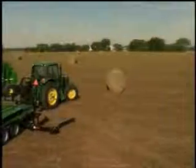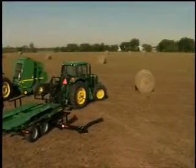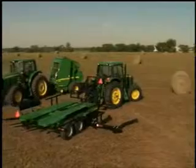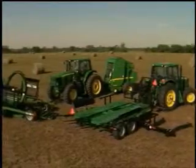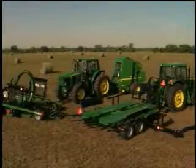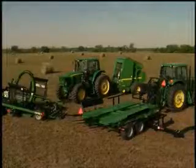Now, when we move into the big round bale type, you can pick 4x4 size bales and balers, and that matches usually, again, the smaller cattle numbers, and then you can go all the way up to the 568 5x6 baler. Right. And as you go, sometimes the features, just like our tractors. Rex touched earlier, we use letter designations on tractors. We start adding things like more monitoring. The monitor, we call it a monitor controller. You can set right there on the tractor where you want to put the twine or how much net wrap you want to put on it, how many wraps. It tells you the bale sizes being made, where you need to feed the baler.